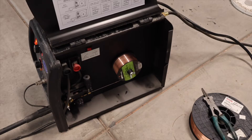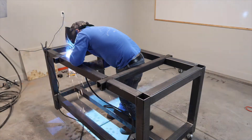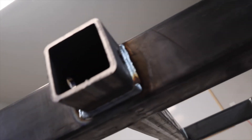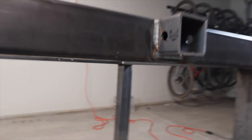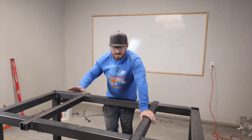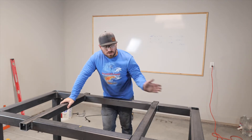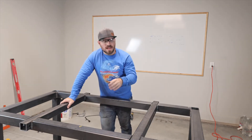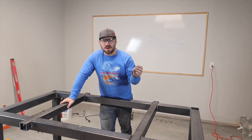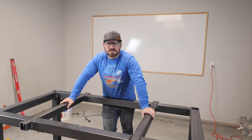Out of wire — that's it. Figured I better show at least one of these overhead welds so everybody can see it's turning out nicely. It's going to look super good when it's all painted. Cross members are completely put in and welded up, everything looks super good. Now I'm going to run over all the welds with the wire wheel to make sure there's no spatter or slag stuck on them, so when I go to paint it doesn't flake off underneath — a nice clean way to make sure everything looks professional.